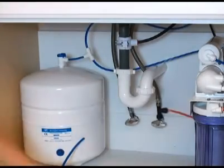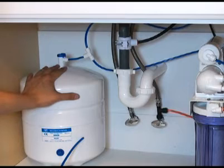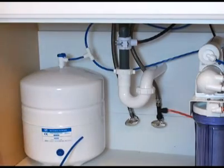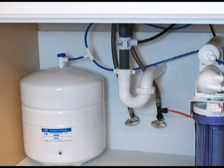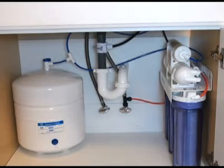Your drinking water reverse osmosis system is now going to slowly fill the pressurized tank full of water. This will ensure you have a few gallons of water on hand at all times. When you need it, simply depress the valve on your new faucet and water will travel up the line and into your glass. Notice the valve on the bottom of the canister as well — it looks much like an air valve on a tire. This is used to adjust the amount of air in the pressurized tank. The tank does come pre-pressurized and for the most part you shouldn't need to worry about this. Now that you're finished, the system should look something like this. You may notice that some of the lines have been clipped for aesthetics and to make sure they don't get caught up on anything.